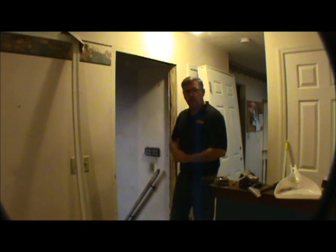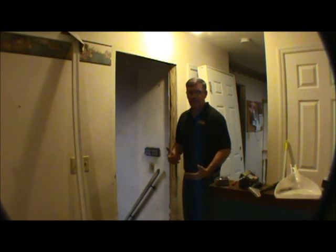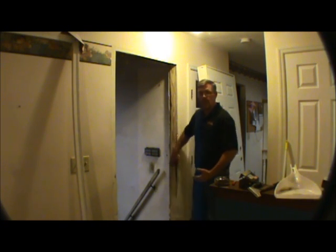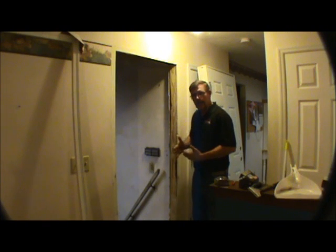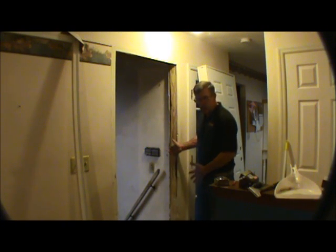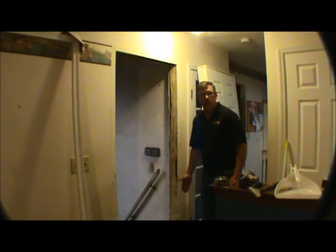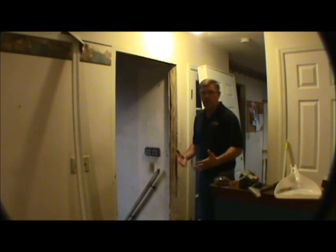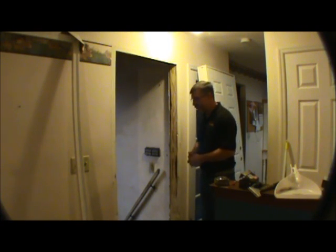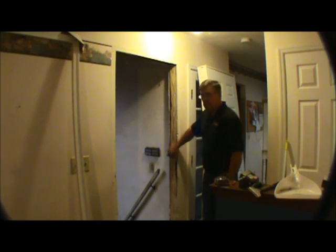Okay, that took quite a few minutes, but in this case, you don't have any other choice but to either take that filler board back out and run it through a table saw if you have that available, or, like what I did, leave the board in place and take the saw and just shave off the 1/4 inch. Probably more than I needed to, but you want to have a filler space to put shims in, so no big deal if you take too much out, we'll just shim it out later. But that does give us a far superior hold there.